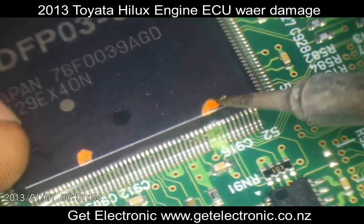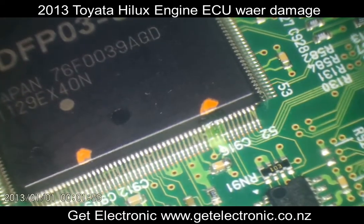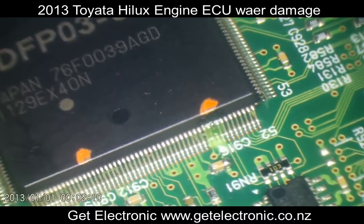I'll just do the top half — I won't touch the bottom one because we know that will never go anywhere. I'll get some wire wrapping wire and use that to connect the two halves together. This is obviously a power feed onto this IC, which is why it's not working.